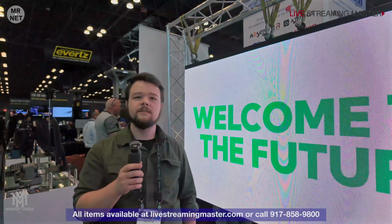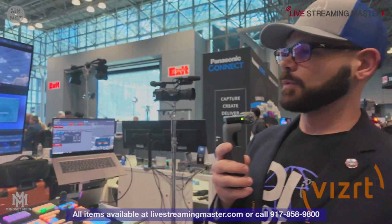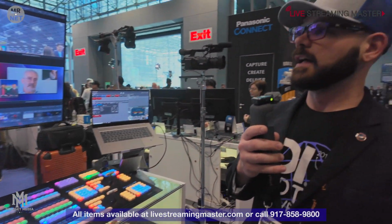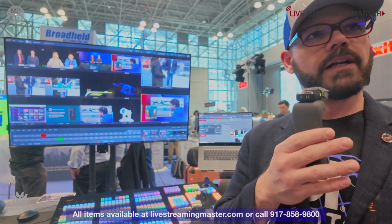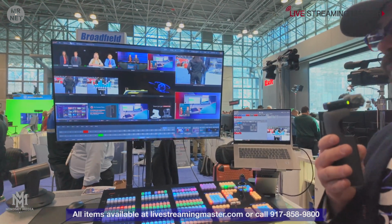So we have the TriCaster Vision, which is the latest 44 input switcher. It has some AI assisted features such as the NVIDIA gaze detection. We've added an input routing matrix, so you don't have to go into each individual input and configure that now. It has selectable keyers on the output, so that's useful for multilingual live recordings and streams. It's also available in 2 different hardware configurations.